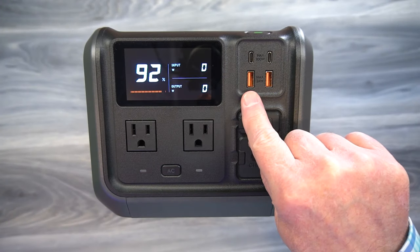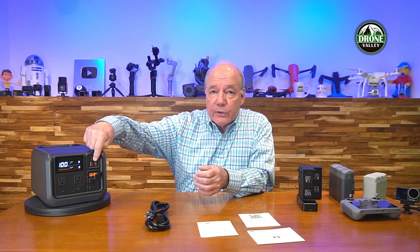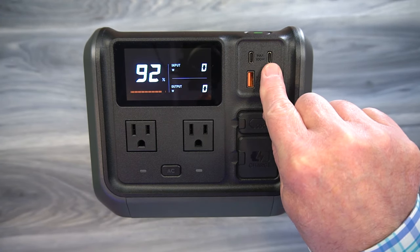There are two flavors of USB: USB-A and USB-C. The USB-A ports are the older, larger style — there are two of them on here. There are also two USB-C ports, which is the latest connection standard used on modern phones, tablets, drone batteries, and cameras. With the two USB-A ports you can deliver up to 24 watts of external power. Each USB-C port individually can deliver 100 watts, which is amazing — most portable power stations give you maybe 30 or 60 watts out of a USB-C, sometimes only combined across all ports. With these, you've got 100 watts per port, enough to charge tablets, laptops, and drone batteries.